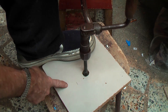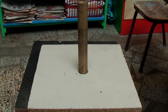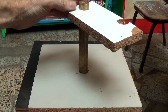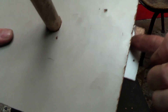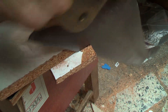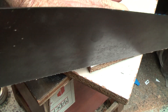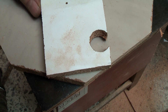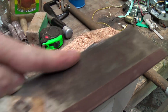For this exercise we are going to need a board with a hole in it that is going to take a piece of broomstick, then another piece of scrap board with another hole in it to go over. It's probably better on the bottom — I am going to turn it over and cut it off here. Then I can put it on top again and use this distance to cut my corners off to make my circle, and then move it around to the next piece and cut those pieces off. Then with it in a vise, using the top there as your guide, I am going to cut off those little points.